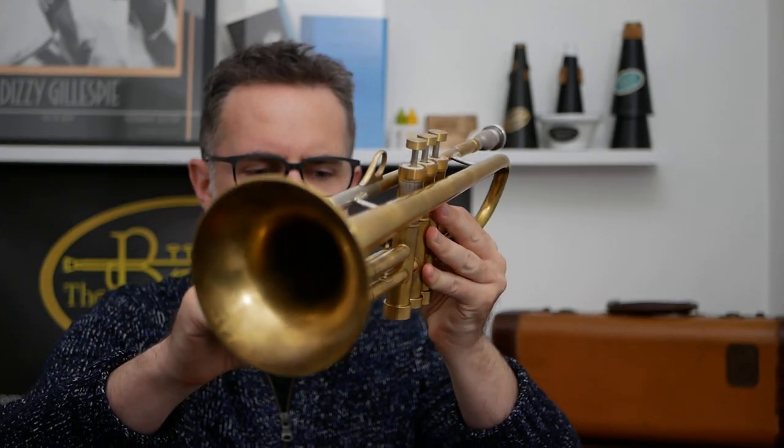You can still see solder patches on bits of this instrument, but yeah, basically with a 3M pad, the green one, that's my first run over, and then I go back with basically cheap $2 steel wool that has a little bit of soap on it, so you get a nice lather, and then that's the secondary finish. I think a lot of people skip that, and then they get these ugly, ugly lines from the scratches. Whereas if you go with the cheap $2 pads, that nice soapy finish actually works to your advantage. The other thing is you have to basically do it in this fashion if you're doing the bell. It takes many, many hours to basically get it right, but it's worth it in the end.